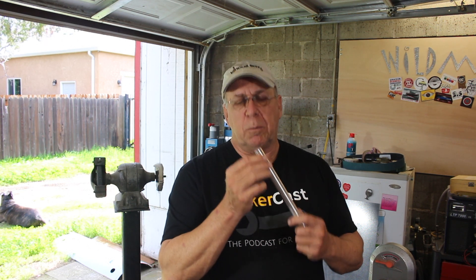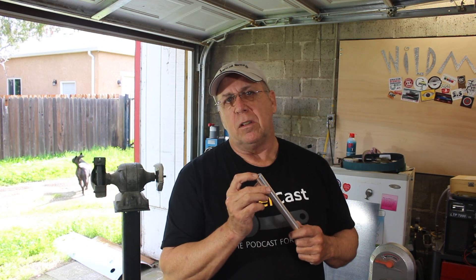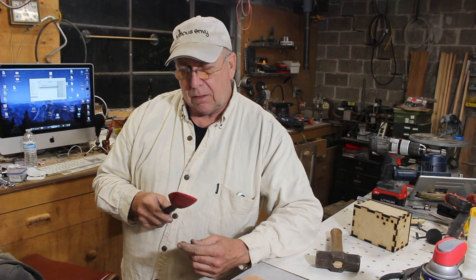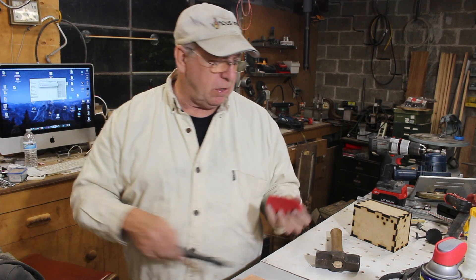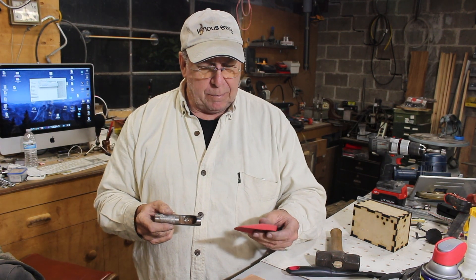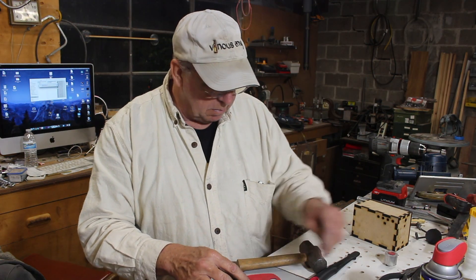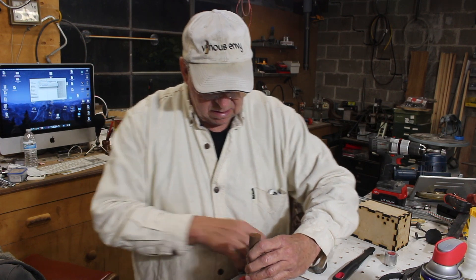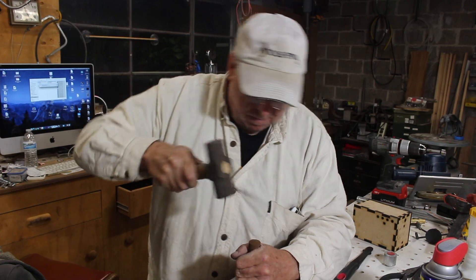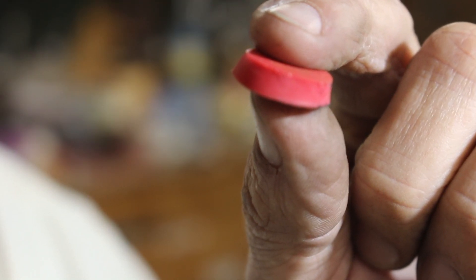I've decided to center drill and tap the end of the piston because I want to put a silicone washer on the end to sweep the inside of the barrel. I cut that piston a little bit small and probably shouldn't have, but my solution is a four-dollar silicone rubber spatula from Walmart. I'm going to cut out a circle with a circle-cutting chisel, then screw it into the end — right there in the meaty part where the handle was. I don't think I could ask for much better than that for a piston seal.